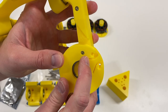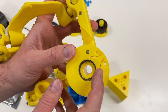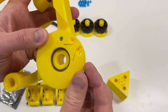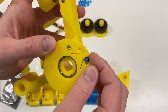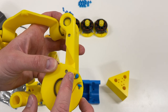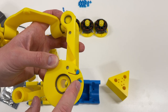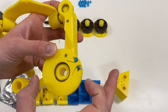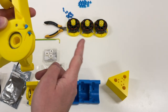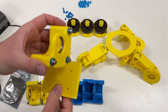The belt is going to be fixed over here. This pulley does not have teeth — we just fix two sides of the belt. I will use small pieces to put in here in order to tension the belt. I have many intermediate sizes so I can choose the right size to get good tension. It's quite important to tension this belt, because otherwise the belt is going to skip on the motor pulleys.